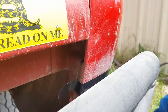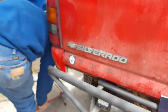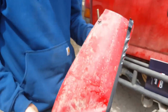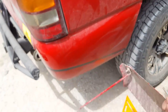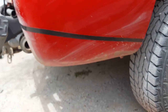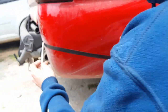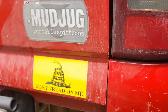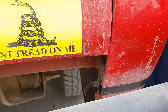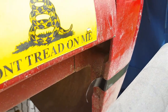So we need to transfer it over to the same side. The easiest way would be to take the piece you cut off and just reverse it backwards — but you can't really do that with the bend in there, and there are some dents. So what I did is I just measured from the bottom of the tailgate to where that cutoff line was on the opposite side — two and five-eighths.